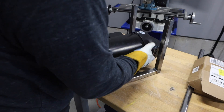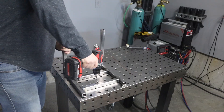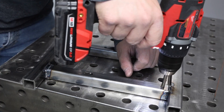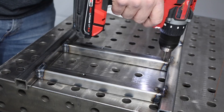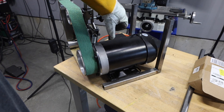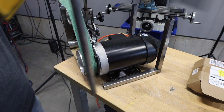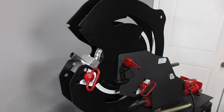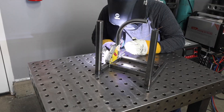I'm gonna test fit the motor and drill and tap some holes to hold it in place. Because I'm using a spiral point tap I'm able to run it right in with the drill and have pretty good success with that. Portability is really important so I'm going to try to put a handle right there — I'm thinking if I take some one inch round tubing and bend it at 90 degrees I'll be able to put a handle in. So I've put it in the bender and I'm bending it around. If you don't have a bender you could just make a couple miter cuts and put a square 90-degree miter joint.